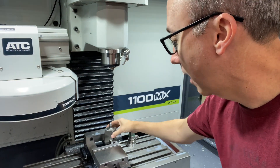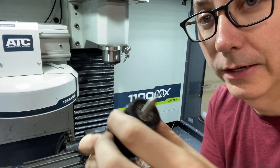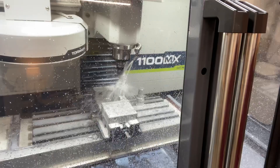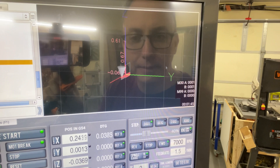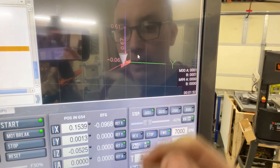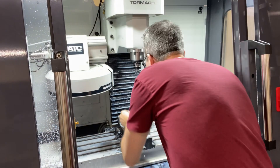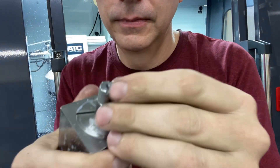I've got my workpiece set up here in this collet block. I have a 1/16-inch diameter end mill that's going to come in and just take very light passes and make that little groove. We'll see how that goes. You can see the tiny amount of depth it's taking because it's such a tiny little end mill — I'm just being very delicate with it. It's all kind of chewed up, but a little file — that'll be perfect.